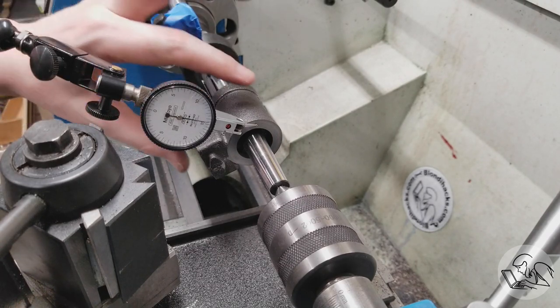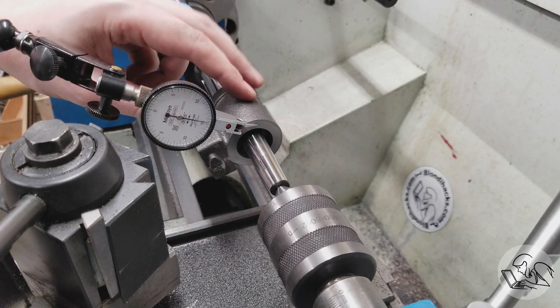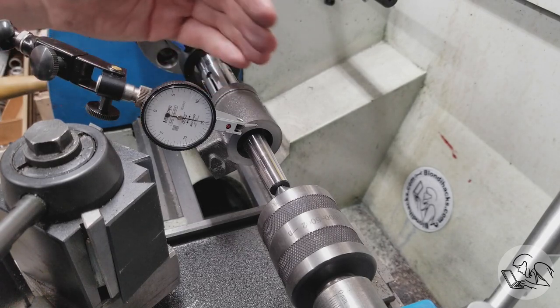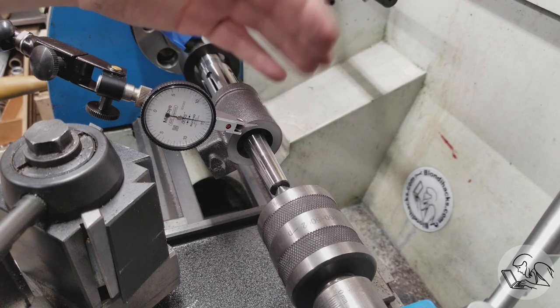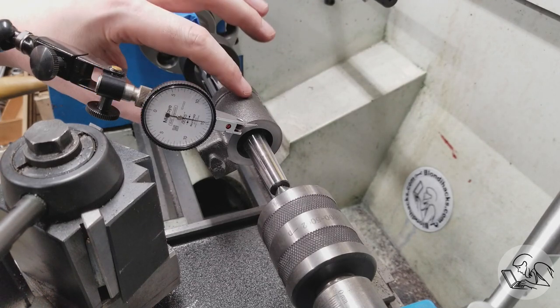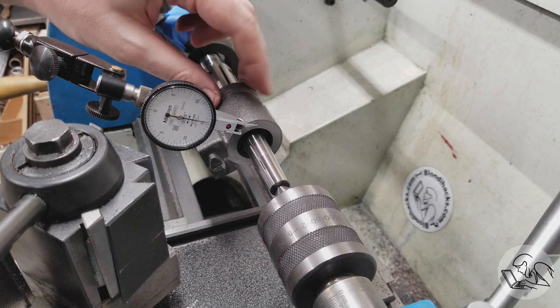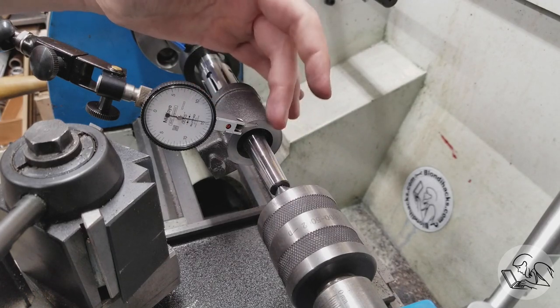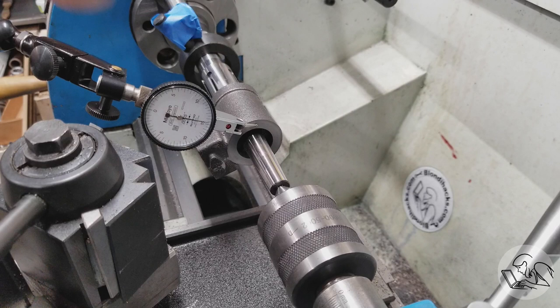I think what I'm going to do is flip the cylinder over on the frame. What that's going to do is make the steam chest stick out the other side of the engine compared to how it's supposed to be. I can get away with that because so far the entire engine is still symmetrical on its short axis. All this will mean is that all of my valve gear is going to move to the other side of the crankshaft, but the crankshaft and everything back there is all still symmetrical. Another option I considered was flipping the cylinder end for end, but the problem is that reverses the steam ports which are asymmetrical. So I think flipping it left to right is safer.